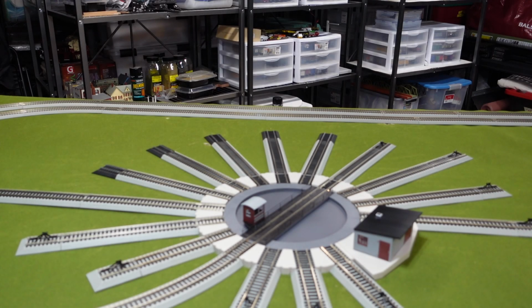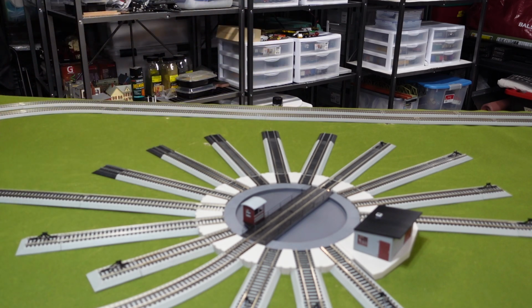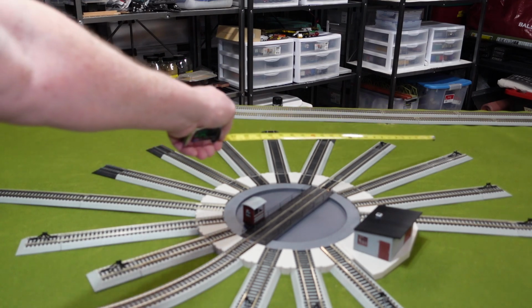What we'll do first is take some measurements. First, we need to know how far apart the lights are going to be. If we put the lights at the end of the rails here, they're going to be about 7 inches apart. So when we wire those, we'll make sure that where the light bulbs are wired into the main wire, which we'll point out when we do the wiring, they'll be about 7 inches apart, because we want them to drop straight down below the table, and then we'll run the whole run over to the accessory. And there'll be 1 light back here, so measurement doesn't really matter there.